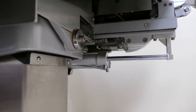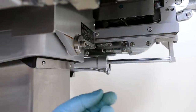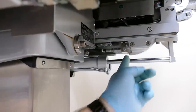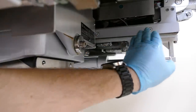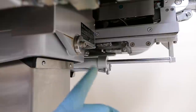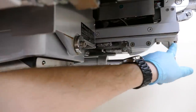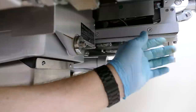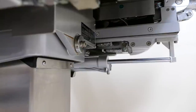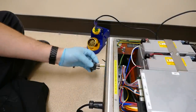Now that the table slide is fixed, up here are these dovetail rails. I'm going to take some high-viscosity grease and put a really thin layer on both sides of these dovetails so they're nicely lubricated — fluids will get up here and they will rust, and when they rust that puts extra wear and tear on your bearings. Make sure it's clean, the fasteners are tight, there's some light lubrication on those rails, and then this table is good to go for the hydraulic slide.